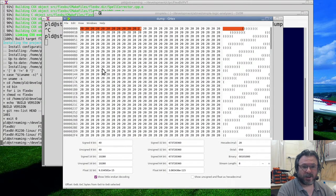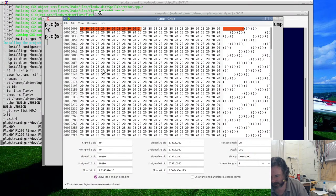No, we're getting the data. The problem is that the data doesn't really seem to be following a pattern I can follow. So what I'm going to do is, where's my DSO? Damn it. Because the DSO has a 1 kilohertz output on at 5 volts. So I can sort of exploit that. I know what the next thing I need to make is, I need to make a signal generator.